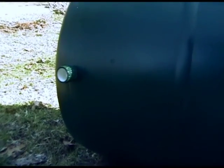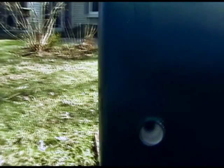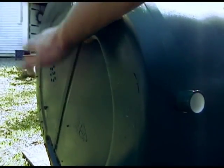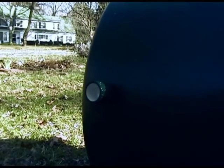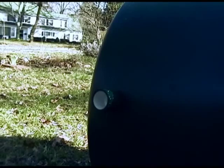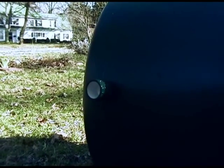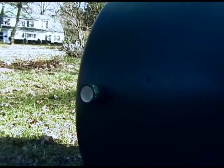When you're constructing the rain barrel, make sure you've included in your designs an overflow port so all the water's not coming back out the top regions, because that's just bad and it'll just drain down the back. I found that the only bit I really needed, the drill bit, is a 3/4 inch spade bit. It makes cutting through this plastic very easy. It's great to go through any of the various PVC pieces.